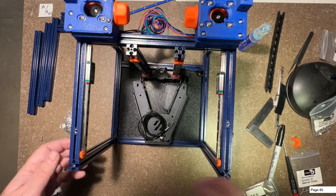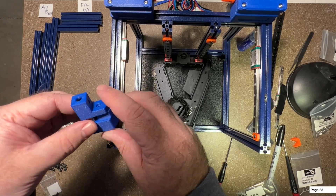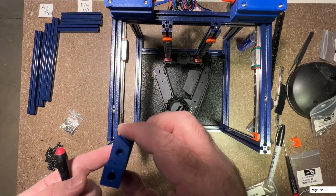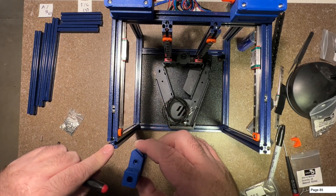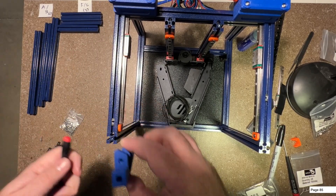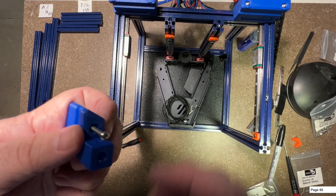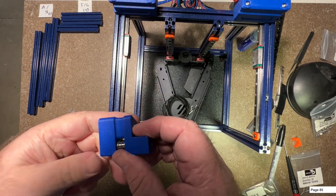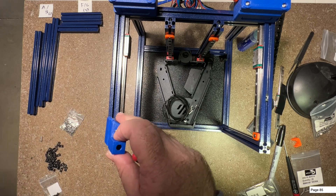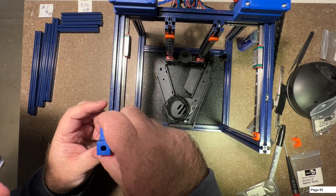We've got all those in there. I can move them all easily, and when I install that piece later I'll be flipping it on its side. I'm going to be installing the B idler first, which is the one with the bigger bottom. I'm going to screw the screw with the idler into the extrusion and slide this nut forward a little bit, because I'm also going to eventually need to get a screw through there. You are going to need an M3x5 screw, so go ahead and insert that now and just slide that in there.